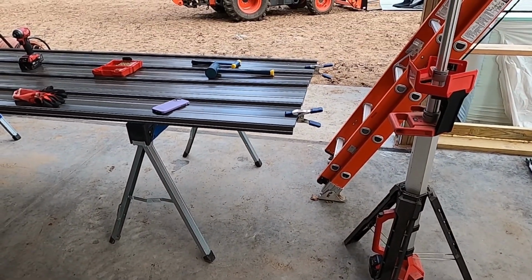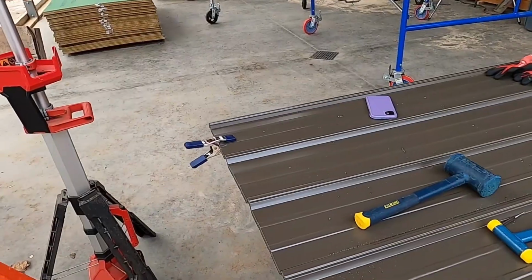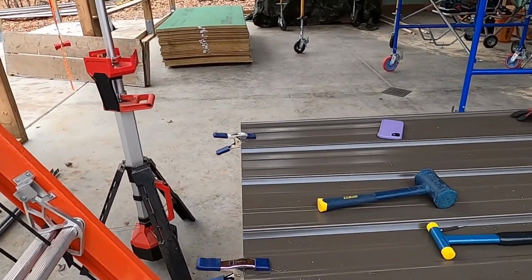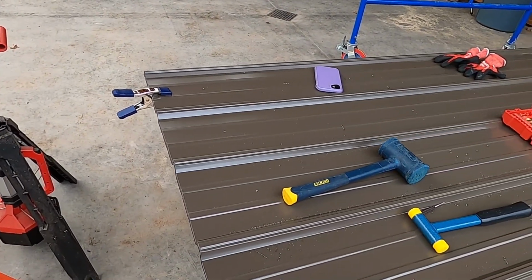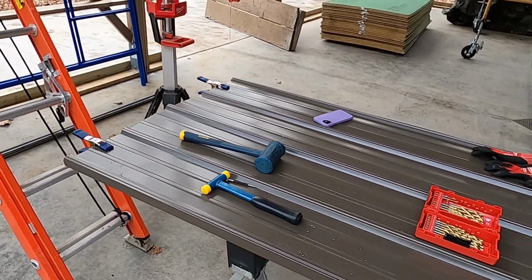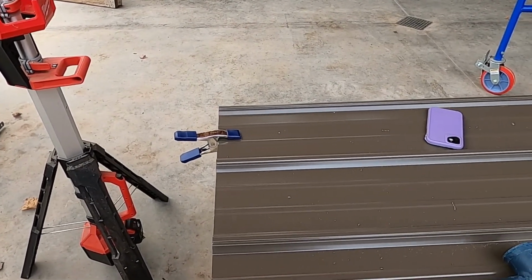Now that clearly sucks. Especially since this was going to be on the bottom of the panel into the gutter there. I should have known when I felt the drill go squishy that something was up, and I should have fully investigated before I plunged that drill back into the hole, and I didn't. Now we have a double hole, and it really sucks. I could just epoxy or polyurethane that second hole. It is on the north side, and it's more protected from UV than most of the building, but I don't know.